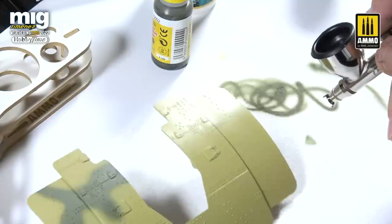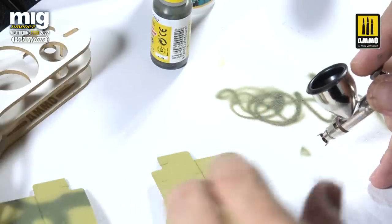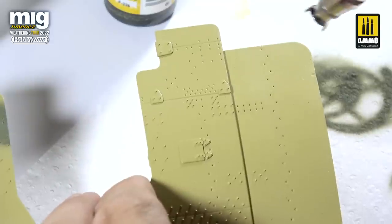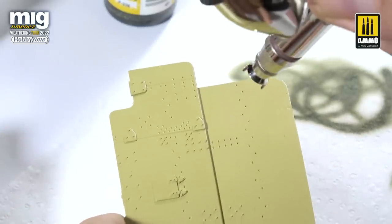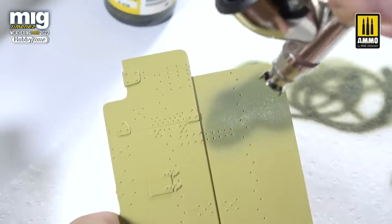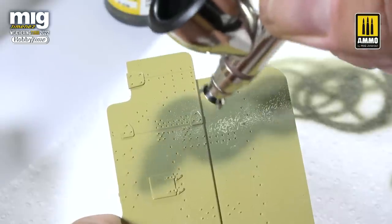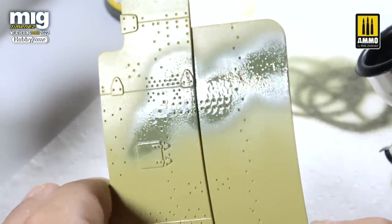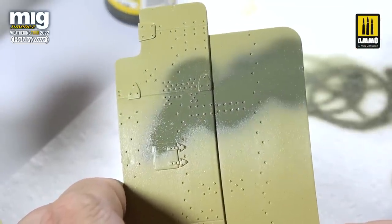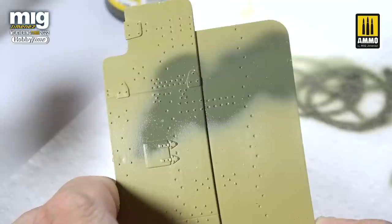And let's see what happens if I paint in the wrong way. For example, accumulating, like I told you that you must avoid, like people painting with lacquer. Some people painting with lacquer do this. They start painting and accumulating, they overflow it, and they expect that when it dries it will be completely flat and smooth, and it's not. You will see a bunch of craters and holes and irregularities in the surface.